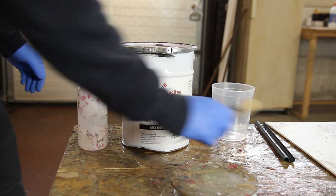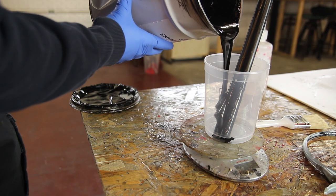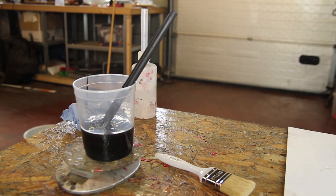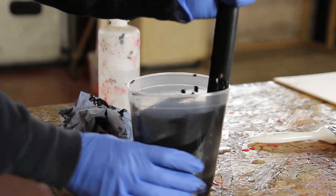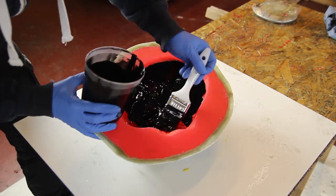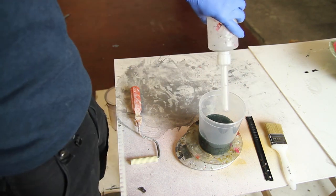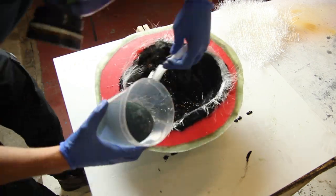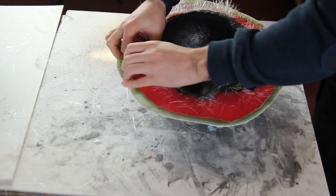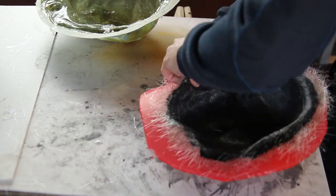Make sure your silicone is dry because polyester resins aren't compatible with water — same goes for epoxy resins. Now a change from the laminating resin: we'll use some gel coat — a colored polyester resin that is slightly thickened so you can apply it on sharper edges too. This will form the first layer of the mask; in this case it's black, though you can choose any color. You mix it again with MEKP hardener and apply it onto the mold to ensure no bubbles on your parts, and you can still finish with paint later. While this first layer is still tacky but cured, you can add the general purpose laminating resin again with some fiberglass — I used a thinner 100-gram fiberglass to apply it into more detailed corners.